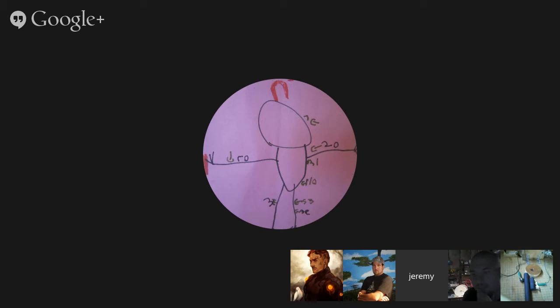Motor start caps. Is that what you're using? It would be the permanent capacitor type motor capacitor. Big compressors use them for starts. Everything's single phase. It has that start winding, and it uses the capacitor to make Tesla's invention. It's another one of his discoveries. The way he learned to wind those AC motors, we still use to this day in almost every AC motor.